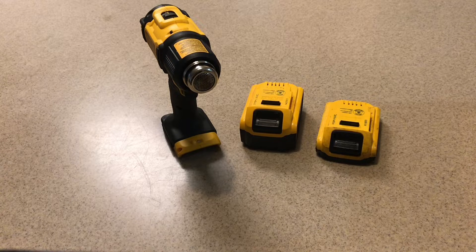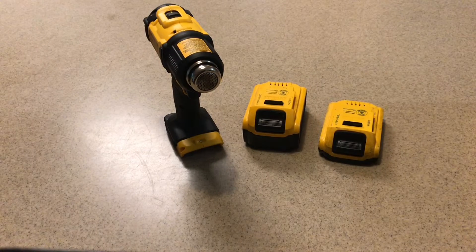To dig a bit further into the theory: the controller on these devices doesn't change — whether it's an electric drill, a saw, whatever tool DeWalt provides — they all have their set circuit breaker. So as long as you don't reach the amount of current needed to trip it, you should essentially get more power out of these batteries. For example, if the 2 amp hour battery is only designed to draw 40 amps at a time and your breaker trips at 90, you're only going to get 40 amps. Now this bigger 5 amp hour battery is about 2 and a half times bigger, so you should essentially be able to draw 2 and a half times more — nearly 90 to 100 amps with the bigger battery.